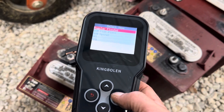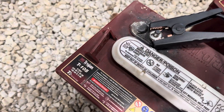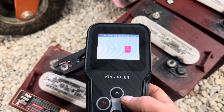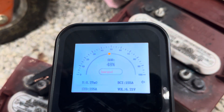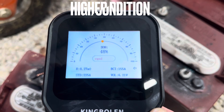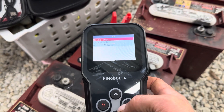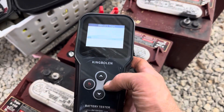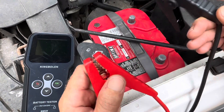I'm going to do a six-volt out-of-vehicle test on each one — regular flooded battery, BCI test, 225 amp-hours. Hit okay, and right there: 48% state of health — retest after charge. Gives you internal resistance at 8.27 milliohms, voltage, and all that. Moving on down the line, same test again — replacement. When you're doing a big bank of batteries like this, it's pretty easy to work through them quickly.